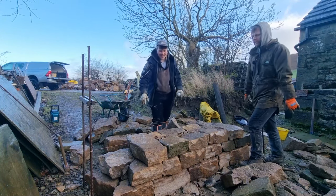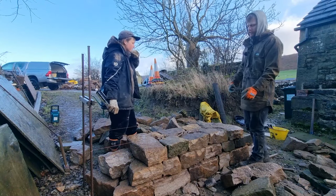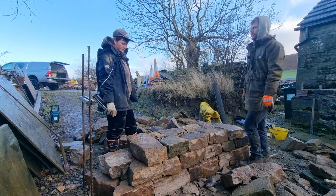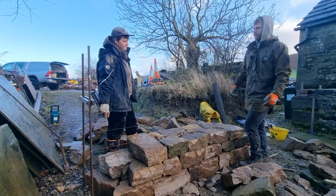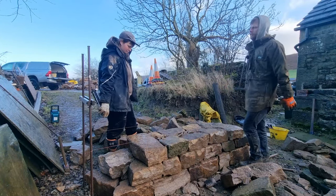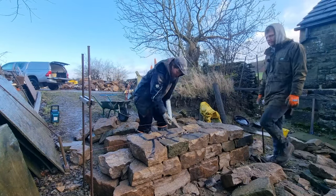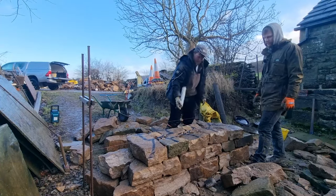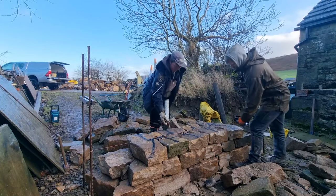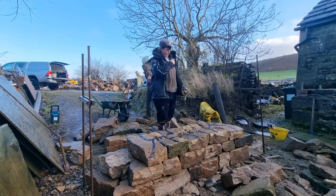This is just to show you what we might do, because you don't just start randomly going, do you? No, you have a plan. If you want to be a good waller, you want to look at what you've got and vaguely plot out so you're not going to mess yourself over. That looks quite good. It's essentially crossing the joints and trying to cross the internals, isn't it?